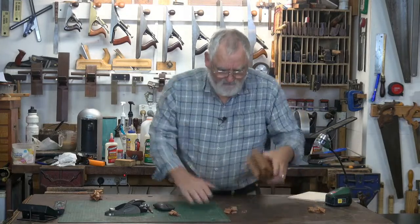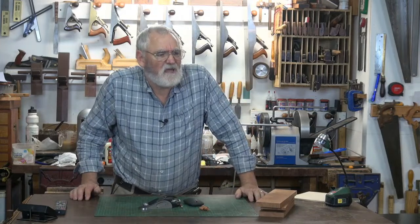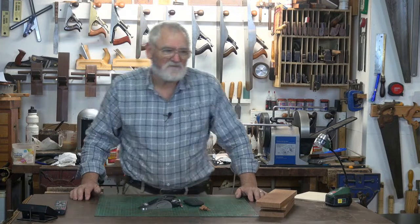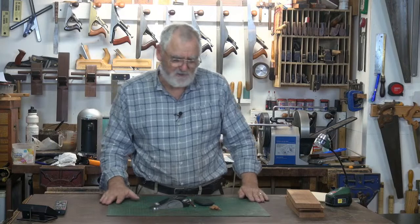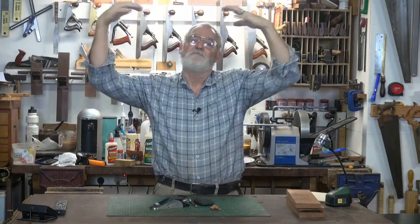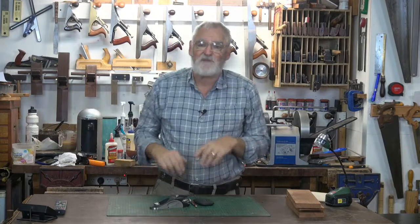The dovetail is really a basic joint, but over maybe the last 50 years, well, I'm dating myself now, but definitely since the 80s, the dovetail has become more of a showpiece joint than an actual structural joint, even though it is a structural joint. It's a compression joint, and it works exactly the same as the keystones that masons use in archways. If you look at an archway, there's a dovetail shaped keystone in there, and that holds the arch together. It's got the weight of the stones leaning on it, and that wedge shape locks it together so the wall stays up. Much the same with dovetails.